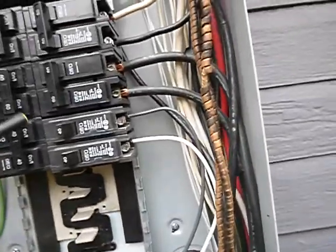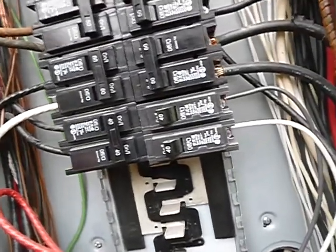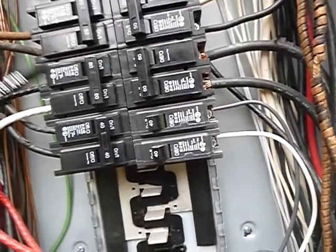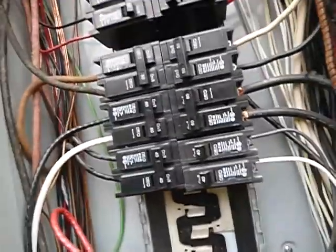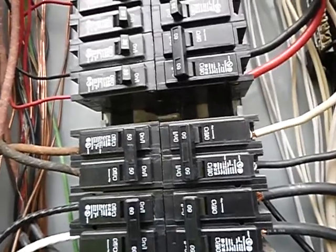We've got white hots here. Because of the size of this cable — 60 amps — I think there's a very good possibility that the condensing unit is over-fused. It's got a 50-amp fuse, so that's a possibility. Though looking at this 50-amp over here, maybe it's not.